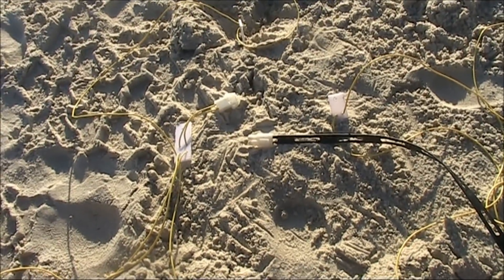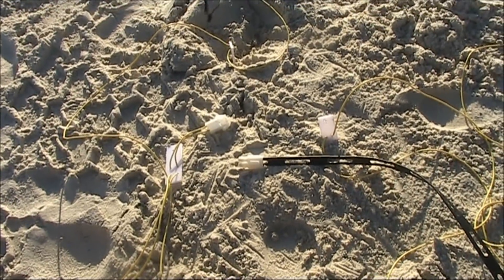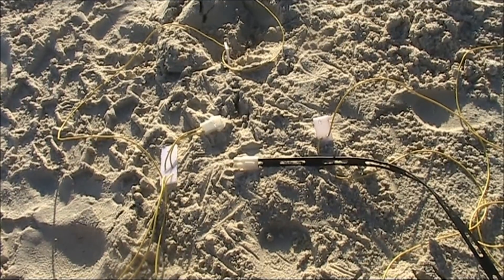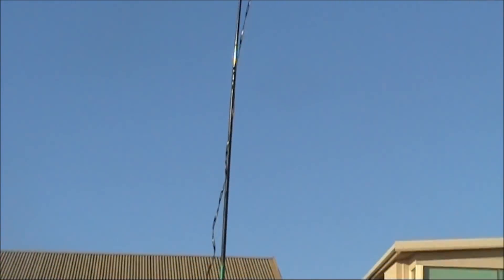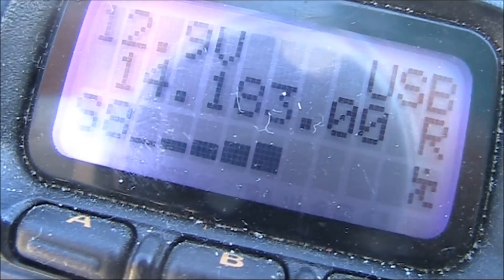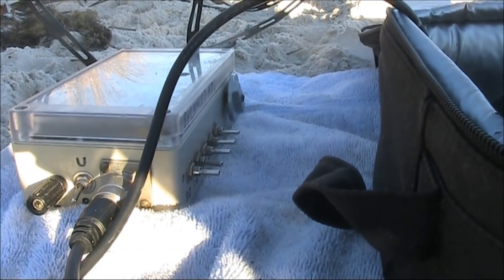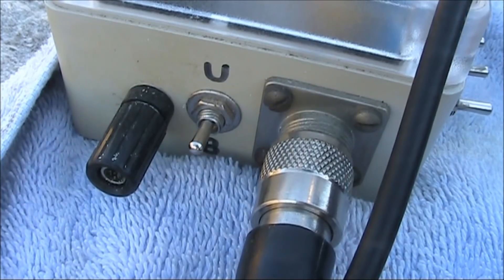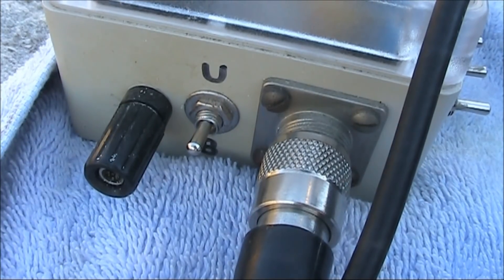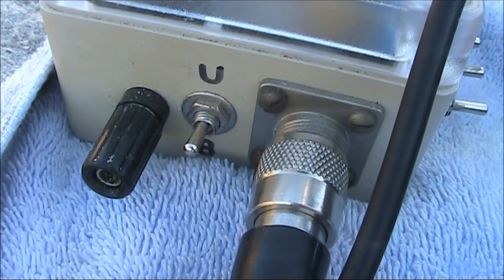That's unlike a vertical dipole, which at just over 10 metres long is a little bit too long for most poles that you can find — at least the type that are light enough to be easily carried around. Adjusting the antenna coupler, I can get it to tune up on all bands between 10 and 24 megahertz. With the antenna coupler in unbalanced mode, the loop loads up on 40 metres, though its radiation resistance will be very low and I suspect its efficiency wouldn't be very good.